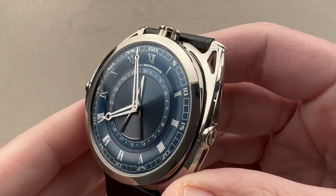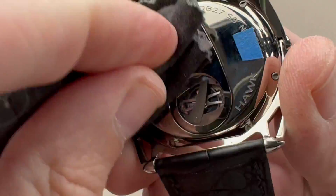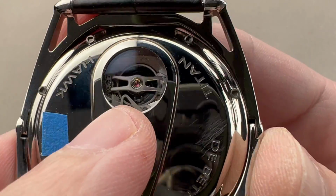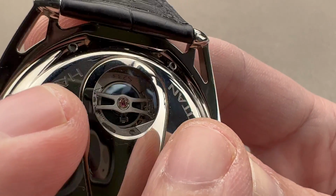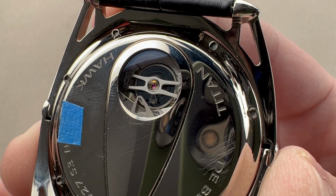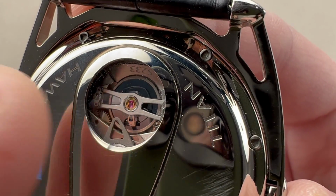So you've got that lovely microlight engraving, and you've got a little bit of a view into the S233 movement, so called because that is the specific gravity of silicon. That is Denis Flageolet's background as a scientist peeking into Bethune watchmaking. Now, as you can see, we have an unconventional but well-developed version of Bethune's triple parachute shock protection that usually uses large flanking springs, whereas here you can use a set of columns and shock absorbers to achieve the same thing. So we have 1, 2, 3 shock protection springs, triple parachute, making the watch both less susceptible to damage but also better able to recenter the balance staff pivot in its cup jewel after a shock to keep better time.